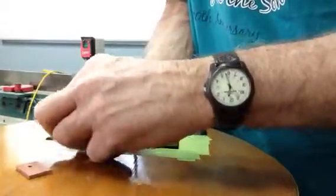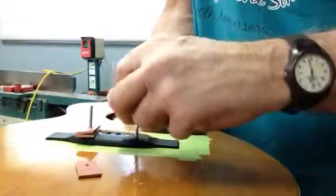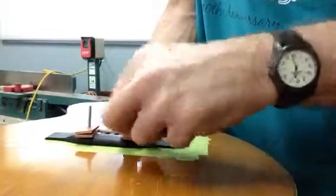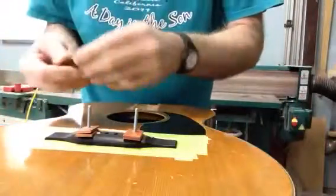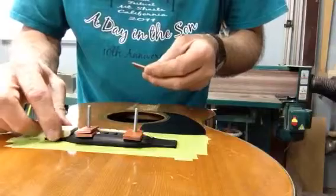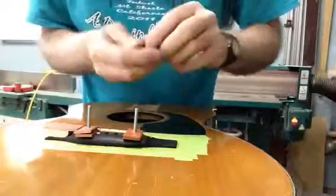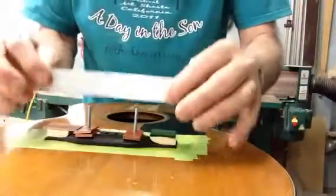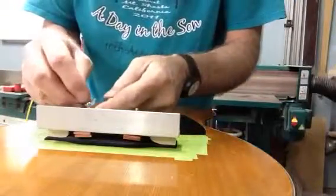So, also, like I said, I pre-did all this stuff, so I cut these little rubber pieces to go over here to space the clamp up, but also has the effect of holding the caul in place while I put the rest of it together. Little pieces here that were radiused to fit the bridge, and then that right on there. This was a different thickness, so this side is a little thinner piece of felt, and this just goes on there. Put the wing nuts on.